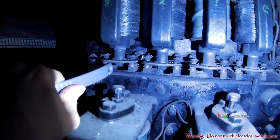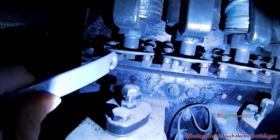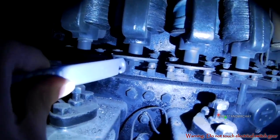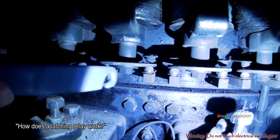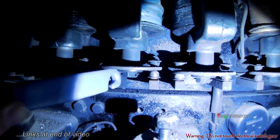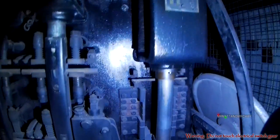When you press a call button, either on the landing or inside the lift, one of these relays is activated. One of the switches on the relay then places a short circuit over your call button, which keeps it active after you've released the button. This wiring configuration is called a latching relay. This lift can only handle one call at a time, so the other call buttons are disconnected while the lift is running. This is a pretty amazing piece of engineering.